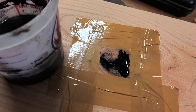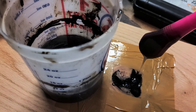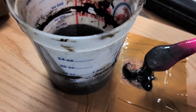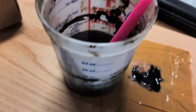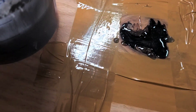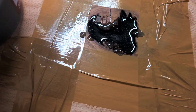I'm going to fill in the void with epoxy. I put tape around so I don't stain a large surface of the wood — only close to the board. I'll let it sit overnight, then sand it down. I'm going to fill this up until it runs over slightly, then let it sit. If I get any air bubbles, I'll take my torch and heat it to make the bubbles dissipate.